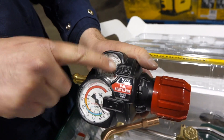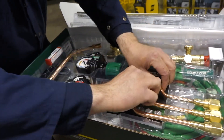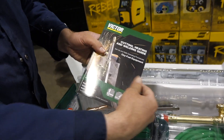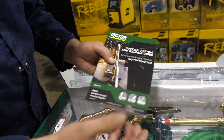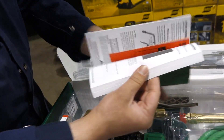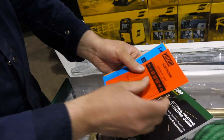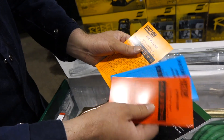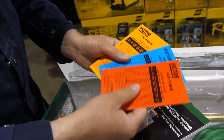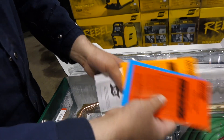Same thing with the acetylene regulator — they give you weld, cut, and heat. Pretty cool, nice big sight glass, you can really see it. Once again, line pressure and high pressure, so that's tank pressure. Down below, brazing heads here — lift them off to the side. You get the cutting, heating, and welding guide. This is basically a go-to kind of textbook that breaks down everything — parameters, setup, that kind of thing. Inside, you get settings for acetylene, propane, and propylene. So these are all cutting tip charts and what pressures to run at. A nice guideline to have included right in the kit.